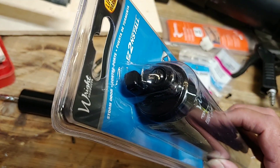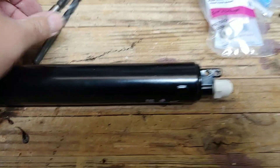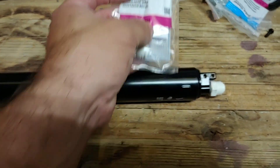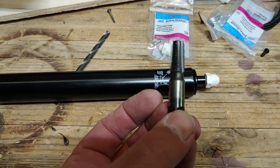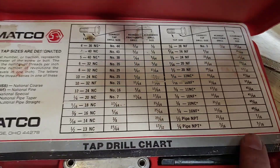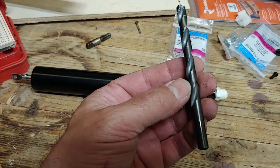So what you do is you take out that screw right there — the adjustment screw — take that out. And you get one of these guys, and this is important: eighth-inch national pipe thread fine thread, and you find the tap for it. Eighth-inch national fine pipe thread — you look at your chart right here. For eighth inch, now it's 21/64s.